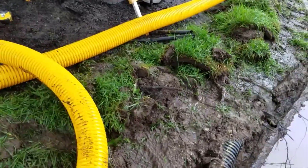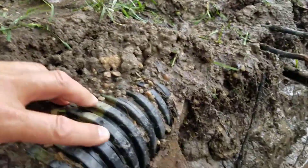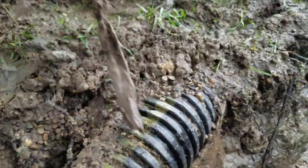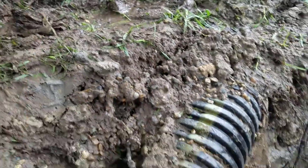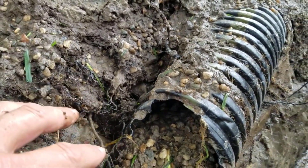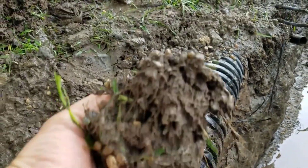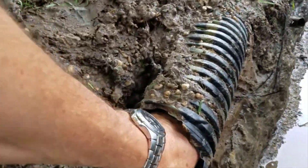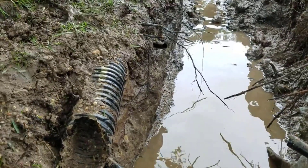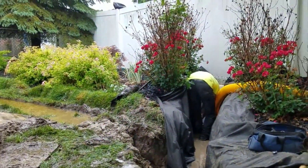We're working on a job that has two failed French drains. They've lived here 18 years and their French drains keep failing. This is your three-slot staggered pipe, and they used the filter fabric on this pipe — it's a polyester. You can see the peastone how it migrated into the subsoil and the subsoil migrated into the drainage stone. Look, there's dirt — that polyester filter soil separator didn't really do a good job. We always preach: wrap the entire trench, stone and pipe included, use a good pipe with a lot of inlet, and use a great fabric. This is a DOT-approved fabric.